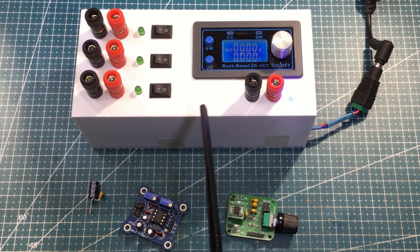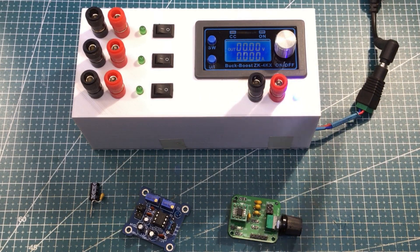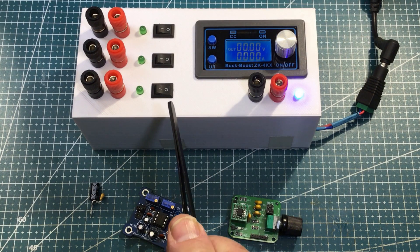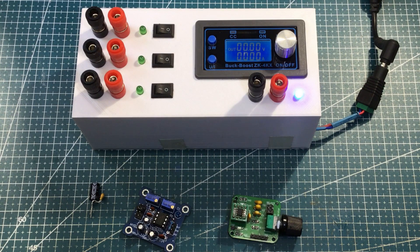This particular power supply, which I made myself, I can route that power through to three LM338s under the hood there, which have been configured to produce 3.3 volts, 5 volts, and 12 volts respectively. So that should be a bit more stable if I hook it up to, let's say, the 12 volt side, and the 555 should be 12 volt tolerant. That shouldn't be a problem.